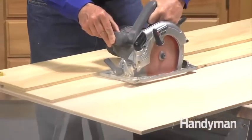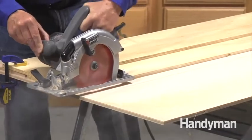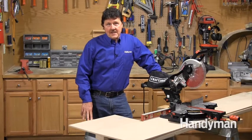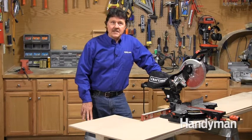The first thing to do is rip the half-inch plywood into two strips — one 16-1/2 inches wide and the other 16 inches wide. Next, we need to see how wide we need to rip the 1x6 divider so our miter saw stand's top is flush with the saw's table.